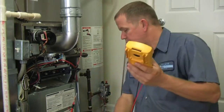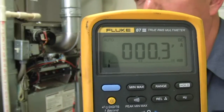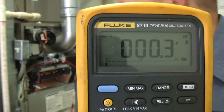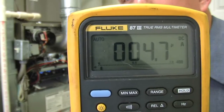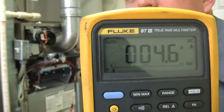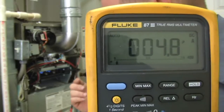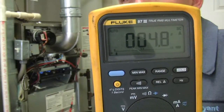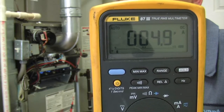The furnace is about to start up — you've got it on microamps, you can read that. Now when it starts, that number should be at least 2.5 or higher. They're usually right around close to 4. This one's reading pretty good — 4.6 or 4.7, that's actually pretty good. Now if that was reading 2.5 or lower, anything 3 or lower, go ahead and pull that flame sensor out, get a fine piece of sandpaper and just clean that off. A lot of times it's going to read 1.2 or 0.8 — when I'm reading like that you're for sure going to call that. So make sure that's up near 4.3 or 4, something right in there.